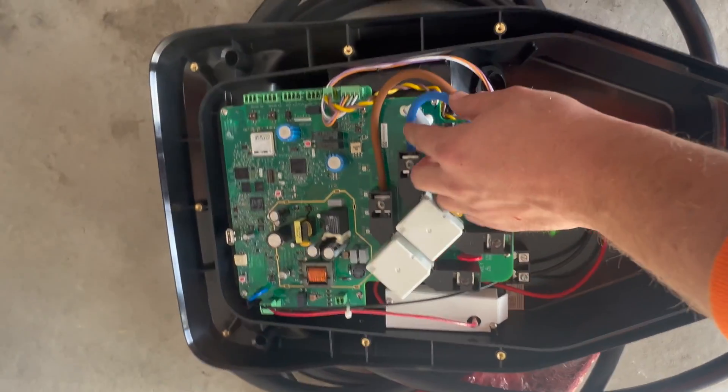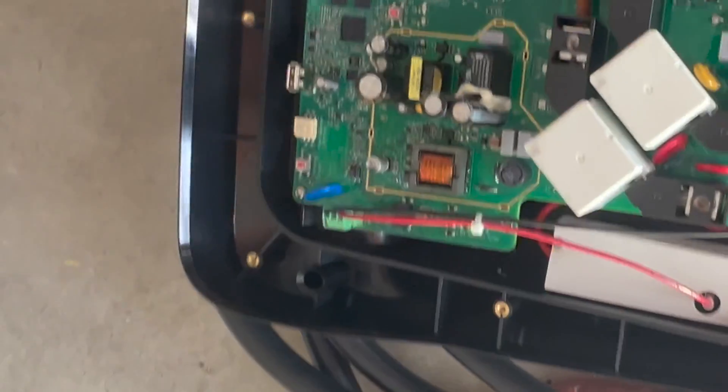The Charge Station Pro is capable of charging at 80 amps, 19.2 kilowatts — that's a crazy amount of power. You're supposed to be able to charge the Ford Lightning in about 40 minutes, under an hour to about 80%. The 80 amps is optional; it needs to be on a 100-amp breaker. But if your main service doesn't allow you to put in a 100-amp breaker, there's a little dial inside the charger that you can turn down — you can go anywhere from a 20-amp breaker to a 100-amp breaker, allowing the charger to charge your vehicle at the max amount of power without tripping that breaker.